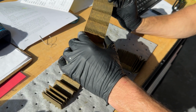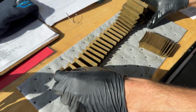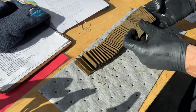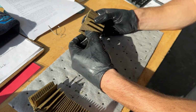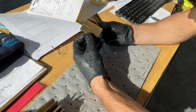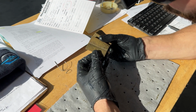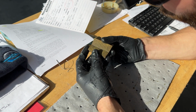One of the tricks once you cut the oil filter open and remove the filter material is to squeeze the accordion filter material in a vise to remove excess oil, so that you can easily see any kind of metallic on the filter material itself.